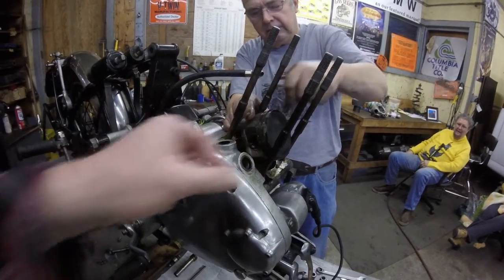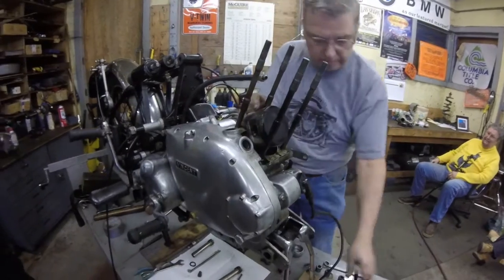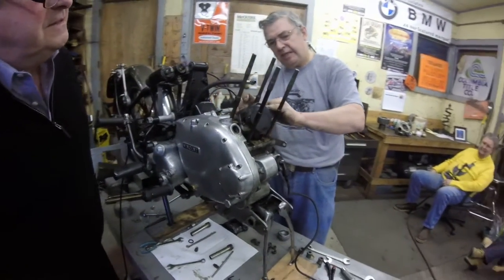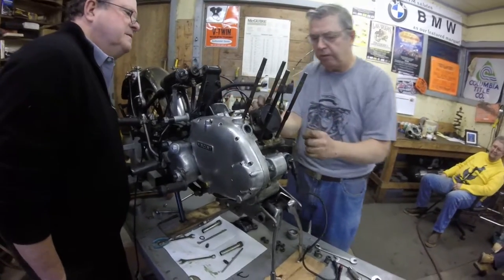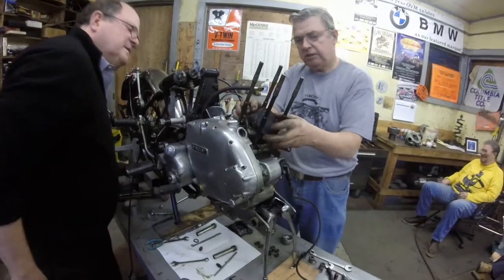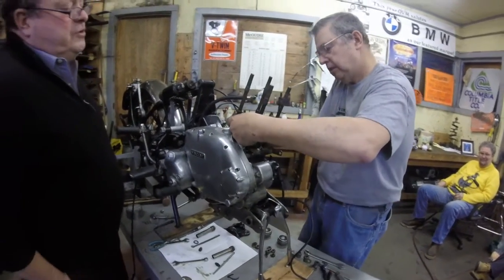And that's smoke. Well, the oil ring's still loose in there. She'd be right. But it's been seized right here because the aluminum's rolled up to it. It might have broken free. But the second one is seized. That's testament to Vincent's, right?